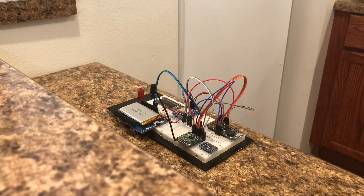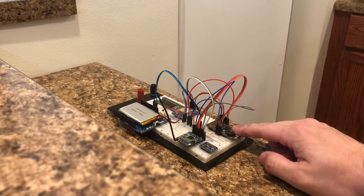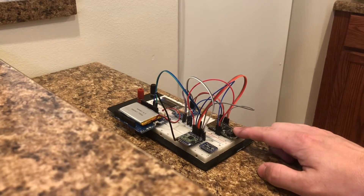Now, you'll probably remember that one of the things I said I had to figure out was how to communicate the destination to the drone, and how to remotely monitor the drone's progress and override it if it strays. This is the base station — this is its microcontroller, also an Adafruit Feather M0. It shares much of the same base code as the control unit, but acts as a primary listener for location and orientation data, and outputs it to a serial console on my laptop so I can watch for progress and any issues. The only time it outputs data through the radio is during the startup handshake process between the quad and the base, so the quad can calculate its distance and bearing from the base station.